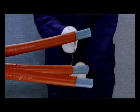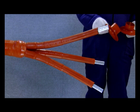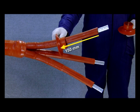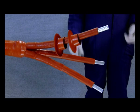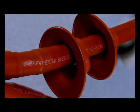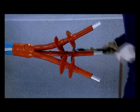Friction cut the XLPE insulation to expose the conductor. Insert the first polymeric rain shed skirt and position it 150 mm below the top of the stress control tubes. Position the second skirt at a distance of 100 mm below the top of the stress control tubes and shrink it in place. Repeat the same process on the other two cores.